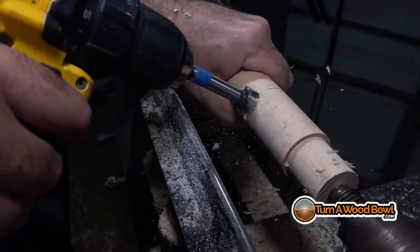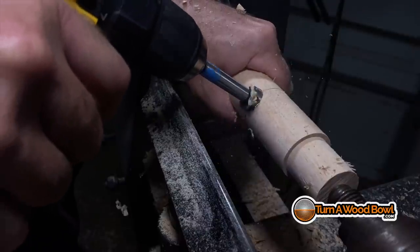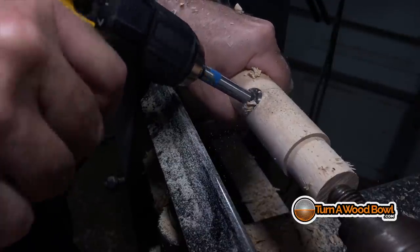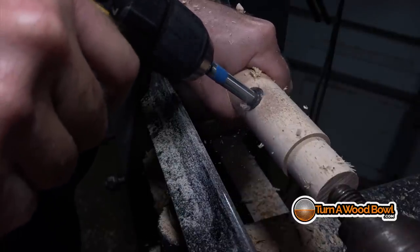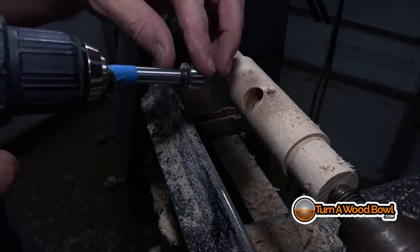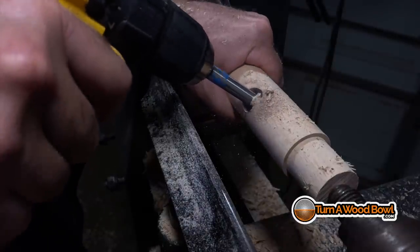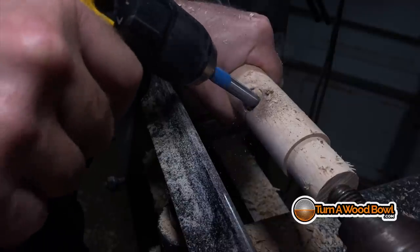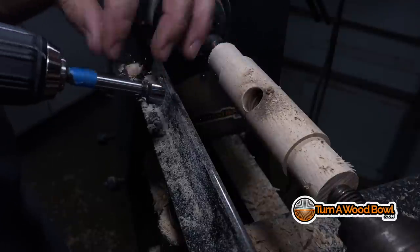I'm going to start a hole on the other side so I don't have a bunch of wood rip out when I come through — that's the benefit of the pilot hole: I know where it's going to come through. This dry hickory is very dense and friction and heat are building up dramatically, so you want to clear those shavings out as much as possible. Very hot.